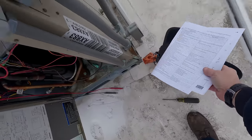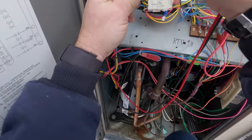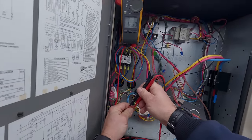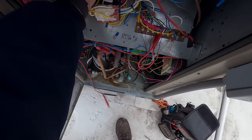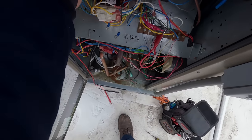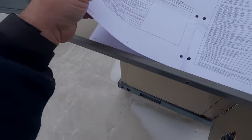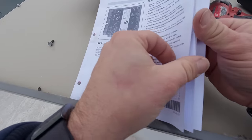Just a regular generic one — I could really care less. A mixed air temperature sensor would be more reliable. Thermistors generally don't go bad — nowhere near that fancy stuff. So we are at 4200 ohms right there, so that mixed air sensor is working I believe. So that means if we get that 620 ohm resistor on there along with an outdoor sensor, it's going to maintain a certain discharge. Mixed air is usually around 55 degrees or something like that. I need to call our supplier here in town and see if they've got it.